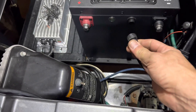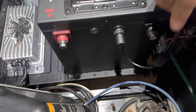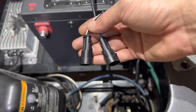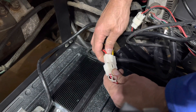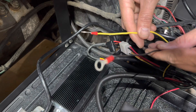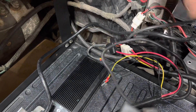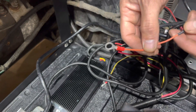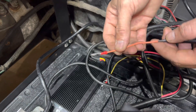Take the voltage meter or LCD screen wiring harness and plug it into the communication port. Just so you know, the two CAN ports right here are currently not used — they may be used in the future, but for now just tuck them away. Go ahead and plug in the wiring harness for the 12-volt reducer. The skinny yellow and black goes to the battery positive and negative; the red and black is the 12-volt supply. The last wire on this harness is the long orange with the eyelet.